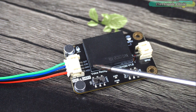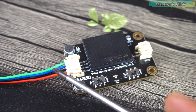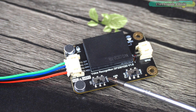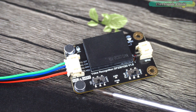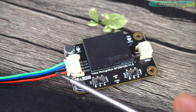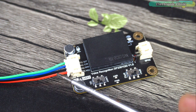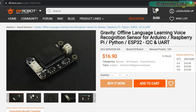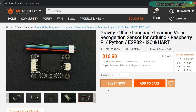The module has 4 wires clearly labeled. With the switch set to I2C, the green wire is SDA and the blue wire is SCL. With UART, the green wire is TX and the blue wire is RX. For 5V boards, connect the red wire to 5V and ground wire to ground. For 3.3V boards, connect the red and black wires to 3.3V and ground. Links to the article and DF Robots official product page are in the description.